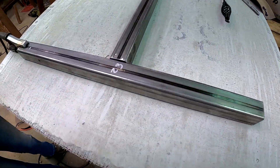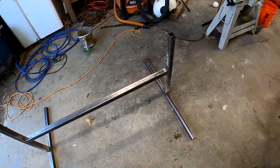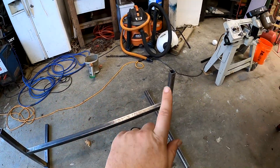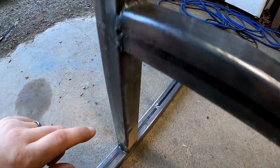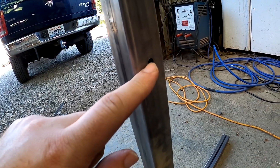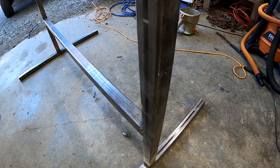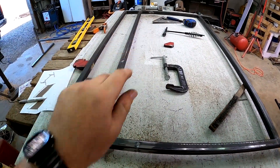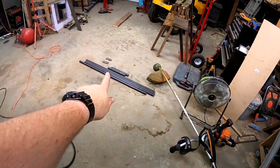Beginning welding and tacking. We've got the frame welded up — two 36-inch pieces on the bottom, 24-inch pieces for the verticals, a horizontal stabilizer bar, and welds all the way around. The hole is in the right spot and is consistent on both sides. We had a butt weld here and over there, and it's solid as all get out. Now on to the rear tilt, which we'll use up those remaining parts.